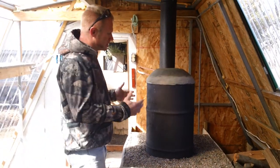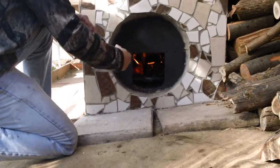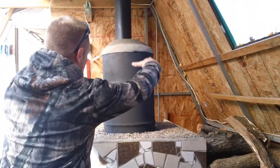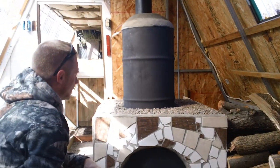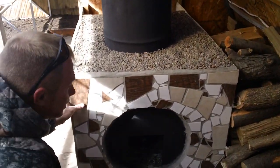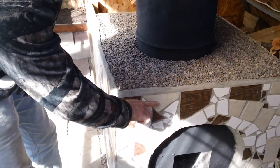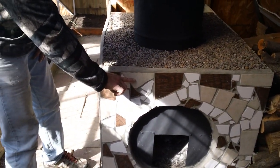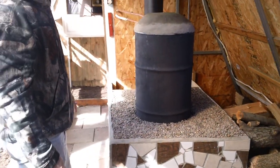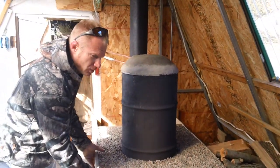Those of you who've followed my channel and seen that I had the double barrel rocket stove - this is the double barrel rocket stove. What I've got is a 35-gallon drum laying on its side with a six-inch pipe up through the center that comes up close to the top, and then this barrel over the top of that with about that much clearance all the way around. We built this box out of durock and metal studs, filled it full of cob - probably up to about right here. We mixed the cob with straw, sand, and of course clay, and just stuffed it down in there. Then the top couple inches we put rock on here, and we pour water in here to get a little humidity coming back because it really dries it out in here. This whole chunk really gets warm and it stays warm for hours.